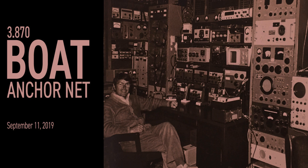All right, somebody said, hey, Lynn, a minute ago. Who was that? K5LYN, W5ISM. I'm cheating. I'm off on my Flex now. And therefore, you turned it down. You had too much. You were pretty wide. And then you dropped down and it was weak, but it's sounding good and staying about 3 kcs right now, Lynn. Looks good. Okay, yeah, I thought it was probably too much, so I pulled it down. But we still got to get this figured out. It's not quite right. Thank you, Doug, for the report.